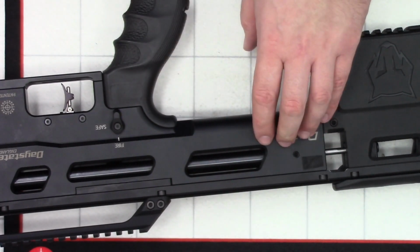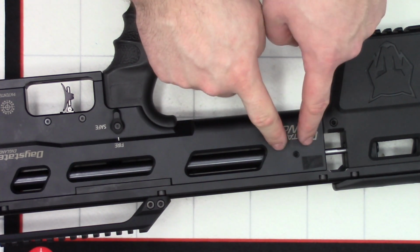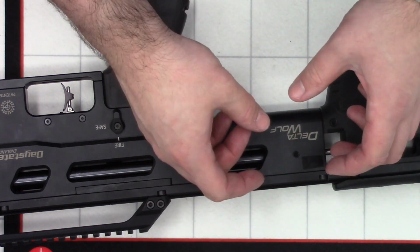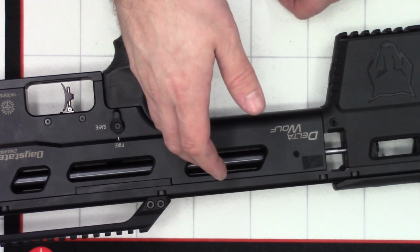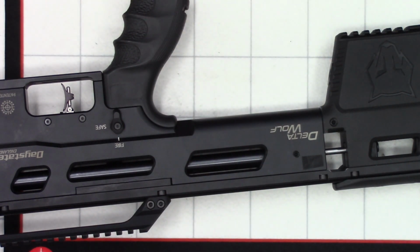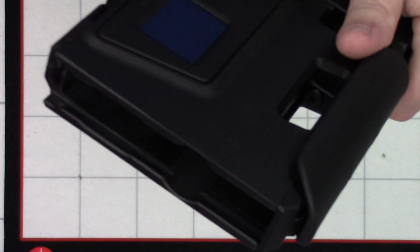The only other thing I will mention about the barrel is that there are two sealing O-rings inside the block here, so roughly one here and one here, and they seal the transfer port from leaking out both sides of the barrel. I did replace them off camera. They are a pain to do. You can, however, do them by just taking the barrel out. So I did mine.